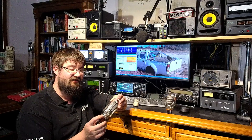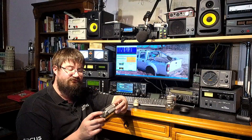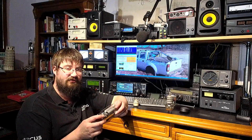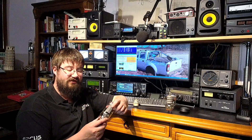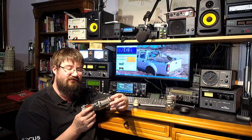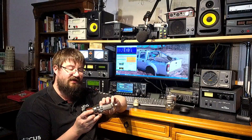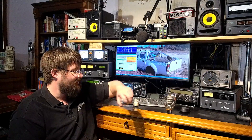Most glass envelope tubes are only made in China now. That said, at 160 watts of plate dissipation they're pretty rugged and hard to kill — a heck of a lot better than 811 tubes. If you've got an amp with 811 tubes, best advice I can give is to chuck in some 572Bs. One author states they have exactly the same grid and filament, but looking at the two tubes the grid and filament are slightly beefier in the 572, and they do seem to last longer. Plus, you won't kill them from mistuning.